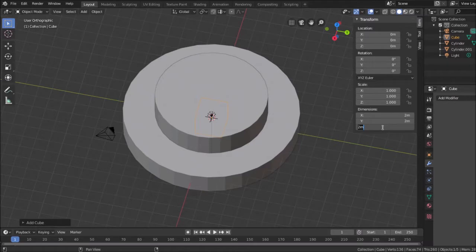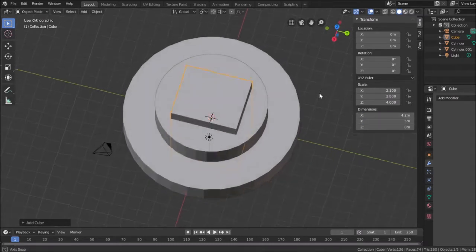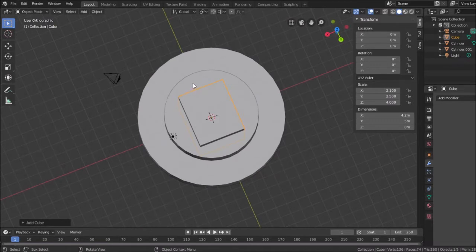Let's just drag it up to about 6 millimeters so we can, okay, right, go a little higher. Let's go 8 millimeters. Give me something to work with here. Its X dimension is going to be the bevel width, 4.2. And its other dimension is going to be the 5 millimeters that I pointed out before. Okay, so this gives us the shaft punch out. And when I punch this, I'm going to add a circle to it. And then, how would I do this? I would union them, to make what I need, I believe.